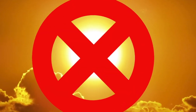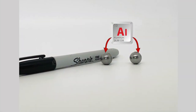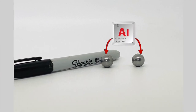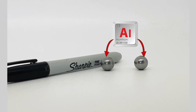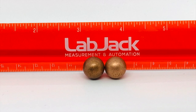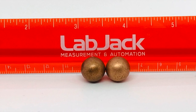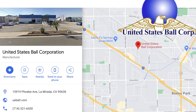However, if you're never going to use your anemometer in direct sunlight, you might prefer aluminum. It's not reflective enough in the infrared to ward off the effects of the sun, and it's notoriously difficult to electroplate. But you don't need to, because it won't corrode, and its combination of heat conductivity and specific heat actually gives it a faster response time than copper. Get two balls of your preferred material that are one-half inch, or about 12 millimeters in diameter.